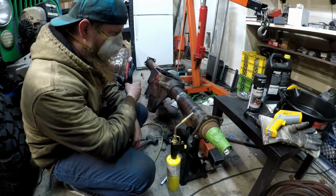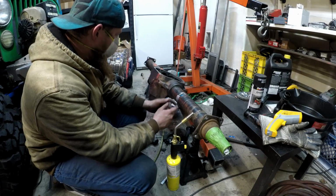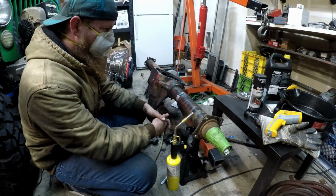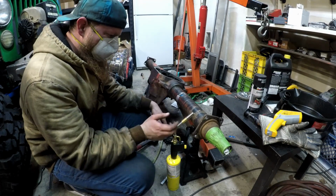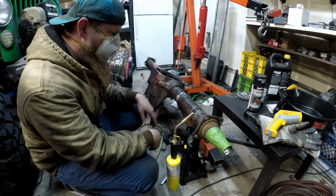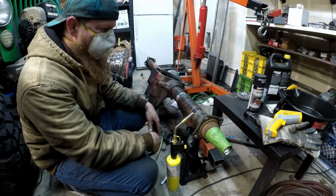This thing is fully welded, and I'm doing the last bring up to temperature now before I stuff some heat blanket in that thing and then wrap it around. Man, that was hectic once I started going. Trying to keep up with keeping the thing preheated up to that 250 mark and a little bit above, while also keeping the cast below 400, about an inch from the weld, per the instructions, was really difficult.